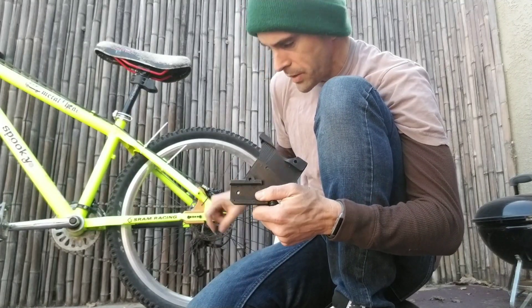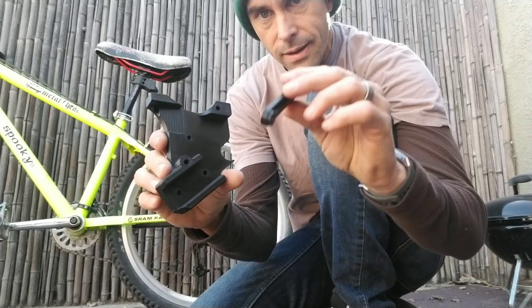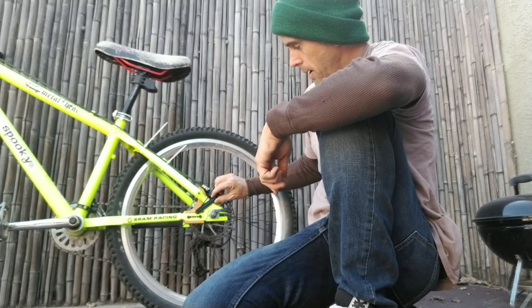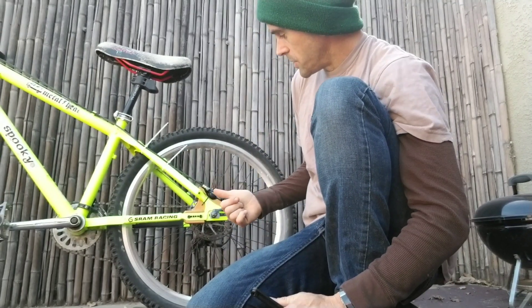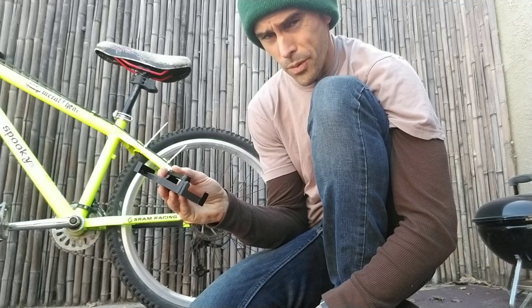So I think the solid version is going to alleviate a lot of that. I also moved this angle here out just a few millimeters — maybe five — to help distribute some of that load. I also made this little bolt mount here, which now has a bump out that the old one doesn't have. That is going to accommodate a cross brace which goes across here on the outside of the frame, and what that's going to do is distribute any inward load onto this piece to keep it from flexing as much. I plan on making an aluminum version eventually, but I'm kind of convinced I could make a 3D printable one that would hold up.